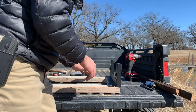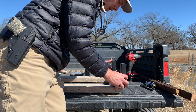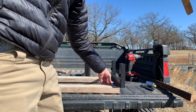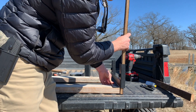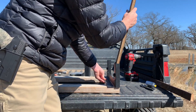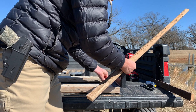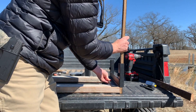So let's assemble it. Setting up the front is the first part. Make sure the way you set it up allows the 1x2 to go through to the ground. This is the incorrect way: if the 1x2 is just hitting the top of the 2x4, it defeats the purpose of the three-point system that prevents it from rocking. Make sure you have it at the edge.